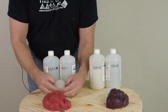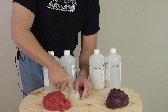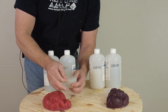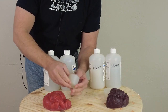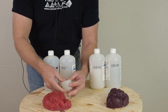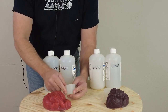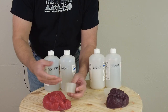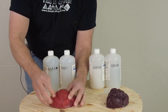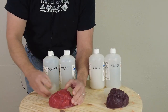The triple O5 is even softer — you can push your finger almost right down to the workbench with very little effort. If I were to pull just a little bit, it would probably pull off a chunk, so by itself it's very fragile. There might be some applications I'm not familiar with that could use it alone, but you would not want to try to use this as a standalone material to make a part. Typically this is used as a filler material inside an encapsulator.